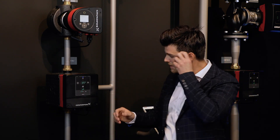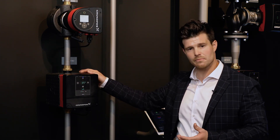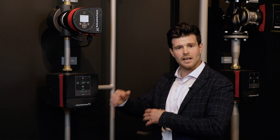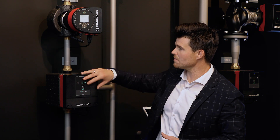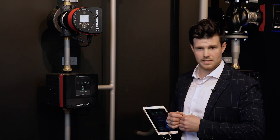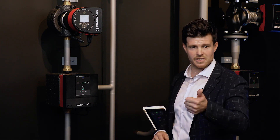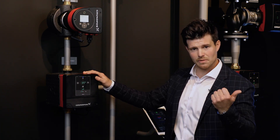Mixit is a digital solution: sensor inputs feed into algorithms. Rather than relying on membranes or springs for pressure dependency, it measures power, temperatures, and flows on the primary side as well as pump control mode. All these data points — more than 100 — can be collected either through Grundfos Building Connect cloud or through the building management system via a single Fieldbus or connectivity endpoint.